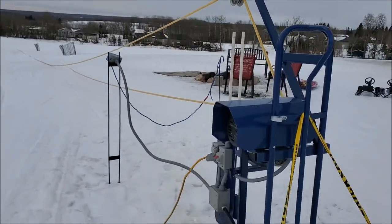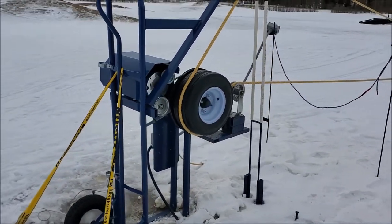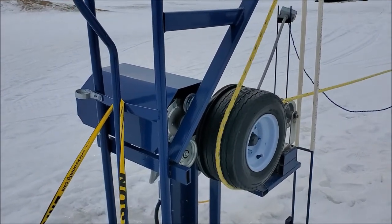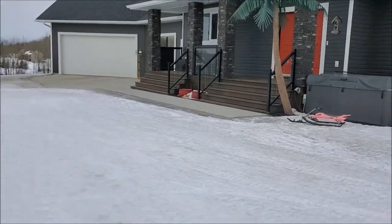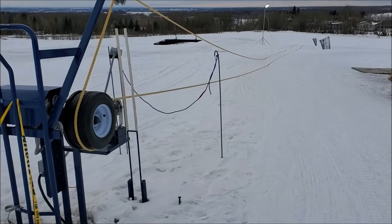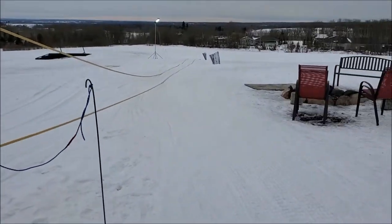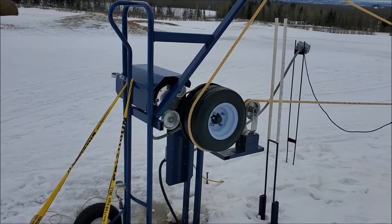A few other questions were about the motor. A lot of people asking what type it is — I do have the serial number and part number in the comments. Essentially it's a 2 horsepower motor, or there's a 3 horsepower version that looks exactly the same. One modification we did was change it from 110 volt to 230 volt. The 230 volt gives it a little more resistance to popping the breaker if you have too much weight on it. I'd recommend the 3 horsepower motor if you want to pull a couple adults at a time; the 2 horsepower is sufficient if you're just pulling kids and maybe one adult.